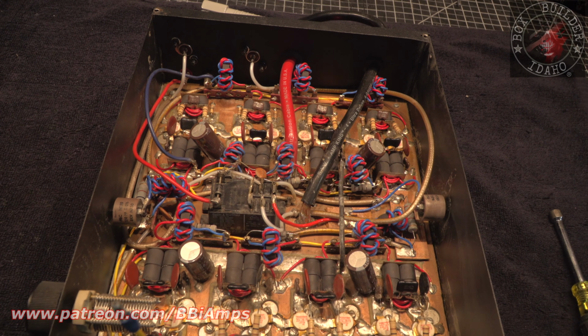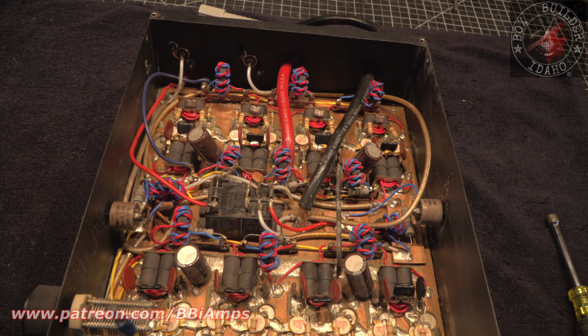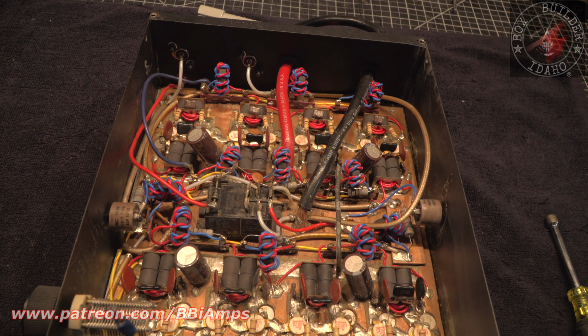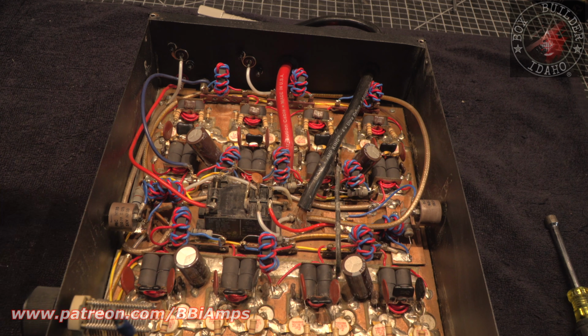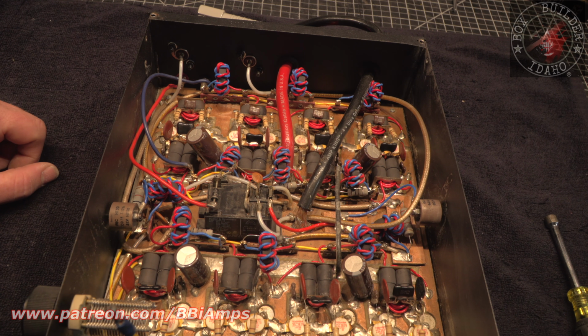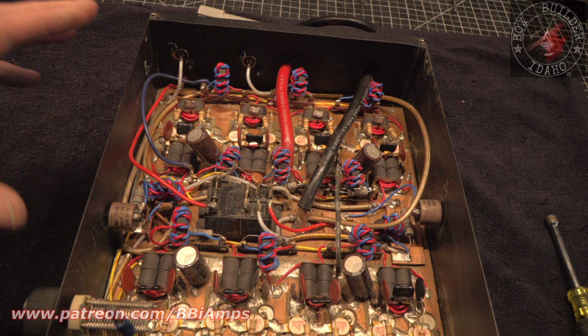Or it's going to cycle out again, and then it's going to be, let's see, 12, and then it'll show up again at 20, like 24, 28 feet. And the same thing with the input coax. You're going to need relatively shorter lengths, probably around 12 feet again, to get this to work.